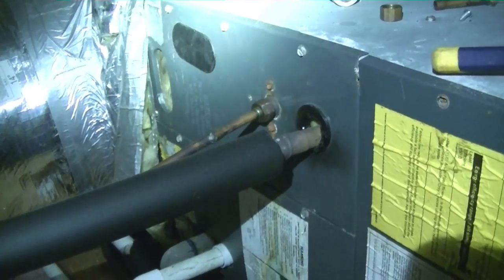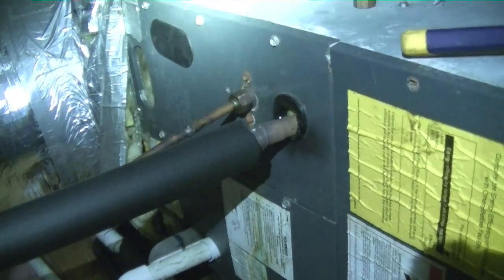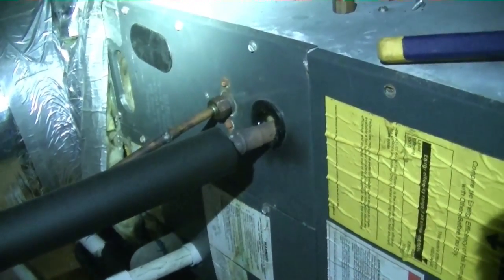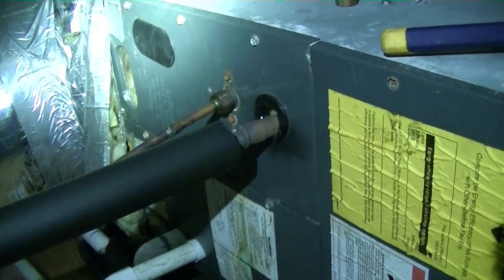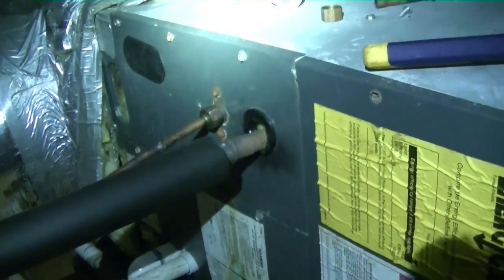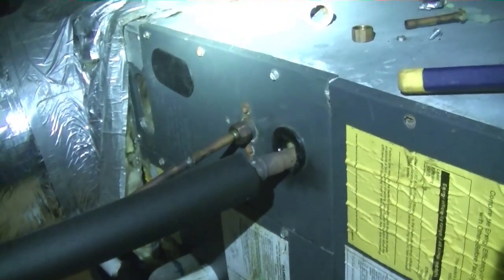The nitrogen has been on there for a couple of weeks and lost about 50 pounds — the coil is leaking pretty bad. The outdoor coil actually has a very small leak, but they don't have enough money to repair that, so they're just replacing the indoor coil. Even though you can't do a proper repair and pull a vacuum on a system that has even a minute leak, this is what it is. The good thing is the copper is wrapping around the attic in a big U pattern, so it's very easy to cut it off and bring it right into the next coil — should be a pretty easy install.